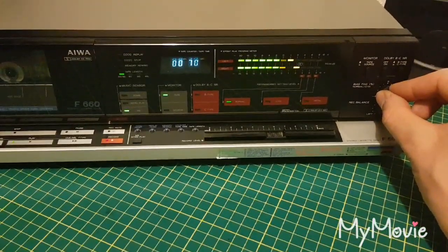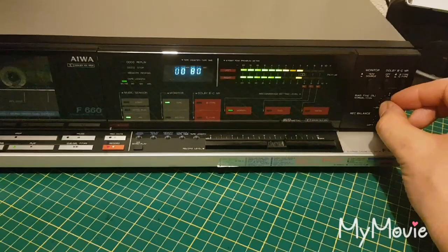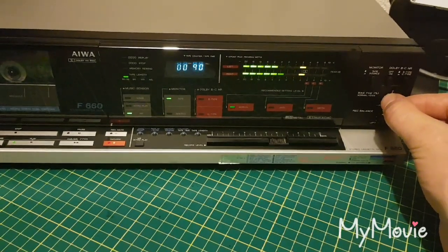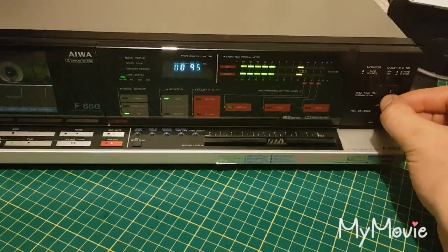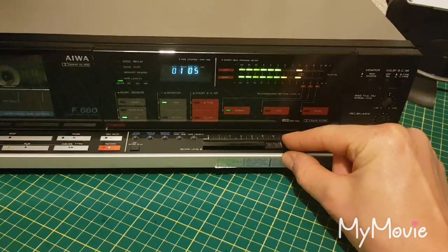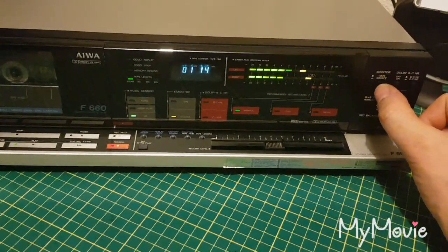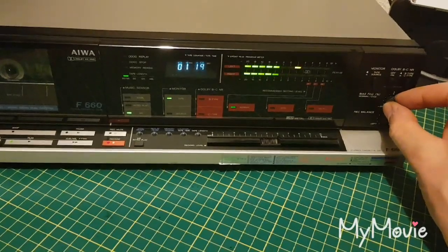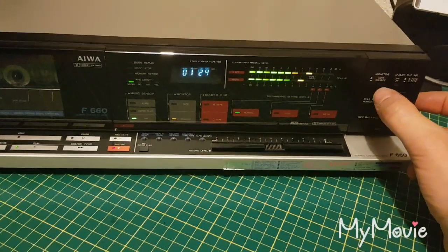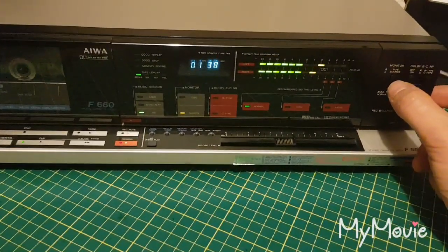This is the bias. So listen to the high end response. Now I'll make it sound very bright, but it'll probably distort. Hear that? That's under bias in the tape. I do like a slightly bright sounding tape, but you'd have to reduce the record level. That's the original. That's the tape, so it's too bright. Source. That's at the 12 o'clock position. Source. Tape.